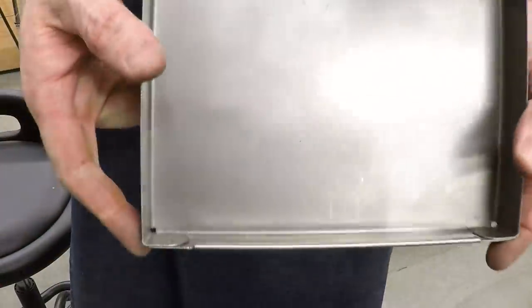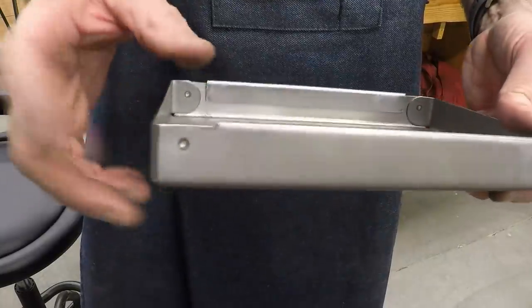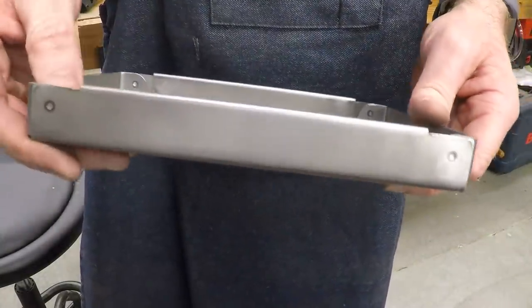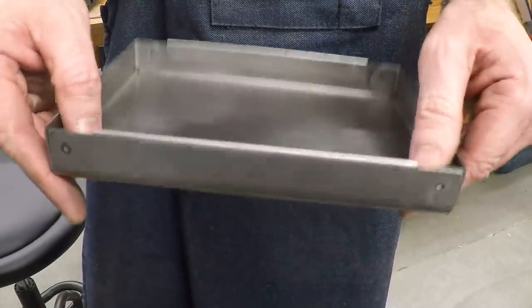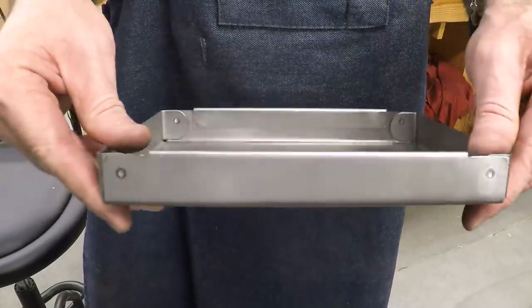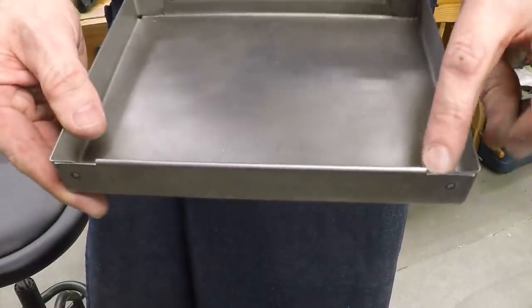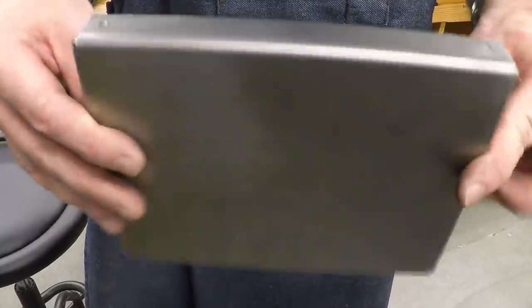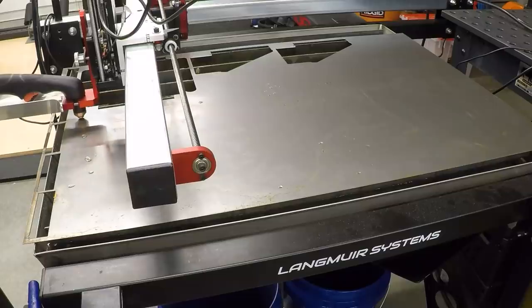I've done a little bit of testing with this and they are durable. The parent metal tears out before the weld lets go. So yeah, maybe a couple of spot welds would be better on a corner like this, but honestly, one is gonna be plenty just because of the limited space in here. There's not a lot of room to put more than that. Okay, let me go cut out and fold the big one.